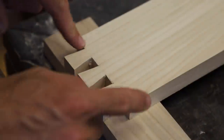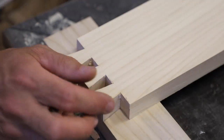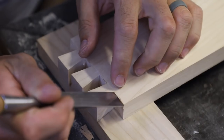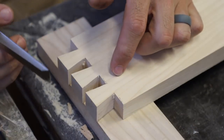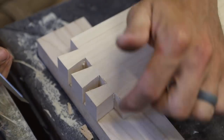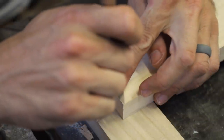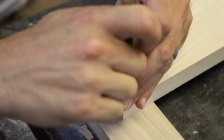So these edge pieces are the most difficult to get a good result on. And so what I've kind of developed, someone else has probably developed this before me, but what I'll do is go from every side, only two taps, and then I'll use a smaller chisel and I can undercut the center. So we're gonna have this material off one more time.